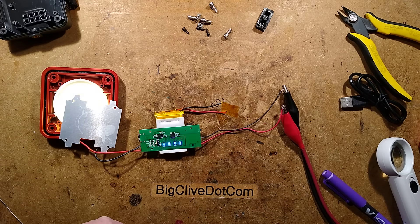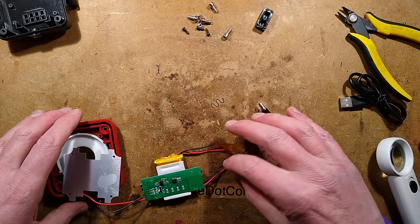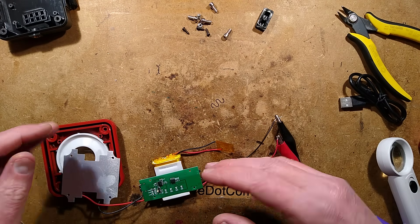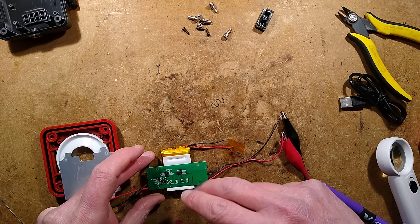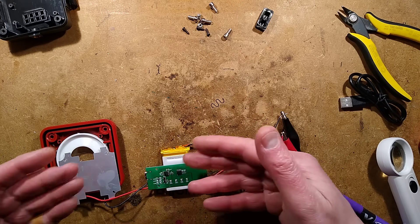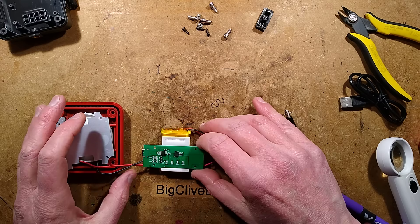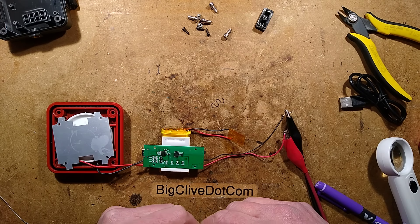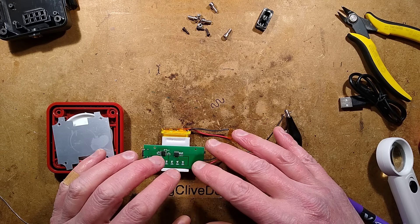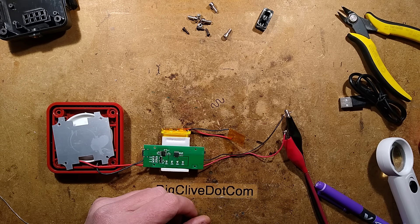That's more or less it. It's an odd design - nice package, but some issues: cracked pillars, no pull-down resistor on the MOSFETs, and the LEDs flashed on startup before the processor initialized due to missing stability. Not sure why they didn't include that 10kΩ resistor - possibly accidental. It's a very basic but functional design, and ultimately after you've hacked the resistors a little bit, it's a very usable, compact and pocketable little light.